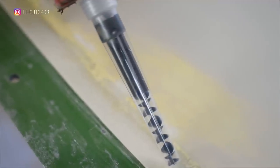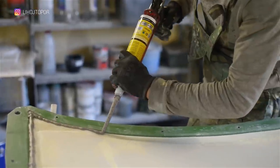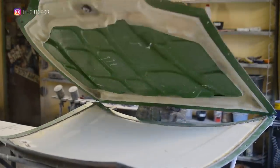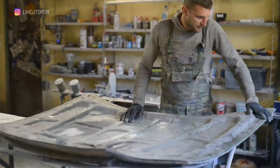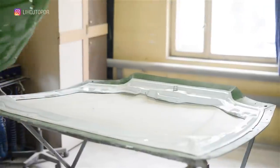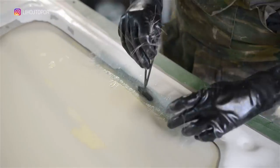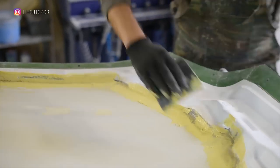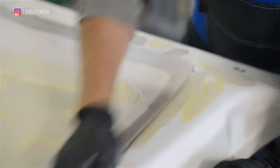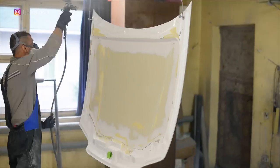The two parts are connected to each other with a special sealant. In order to heat the mold, we do this with the help of the matrices. We tighten bolts around the entire perimeter and leave it to dry. It's clear that in this form it doesn't suit us, so we are finalizing the joints. Andrew finishes work and covers the joints with putty, then half a day of grinding. Finally we have a shape that, in our opinion, is suitable for casting from transparent epoxy. But of course, the surface must be perfect, so another coat of primer is applied.